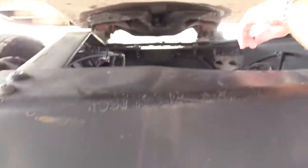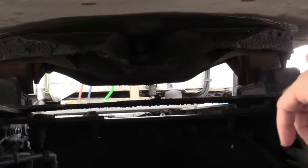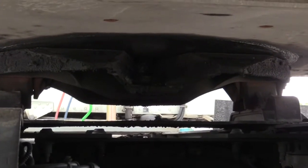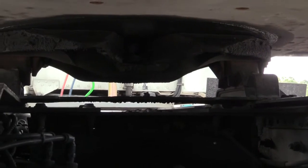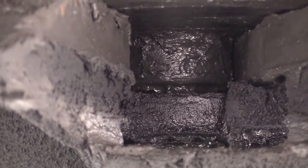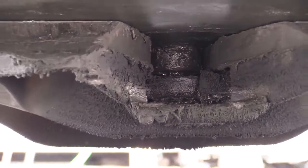we need to look up into the skid plate area, into that V area right there. You can see the locking jaws from the skid plate, how they're securing the trailer to the tractor with the kingpin. So the locking jaws are wrapped around the shank of the kingpin holding it together. The locking jaws are properly greased, and they're not bent, twisted, or cracked. The kingpin that's connected to my trailer apron is securely fastened, and that kingpin is not bent, twisted, or cracked either.